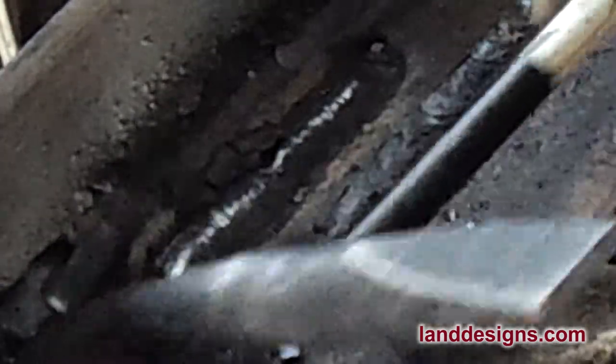One way you can tell if a welder's doing good work — how good his beads are — is when they go to clean that slag off, especially if you're using a 6013 or 7018. I remember my teacher in welding class would actually take the end of the welding rod, put it in the stinger, and just slide it along the slag and it would come right off. The easier the slag comes off, the better the weld. If you're using a 6010 or 6011, it's going to be very difficult to do that because that slag is just so sticky.